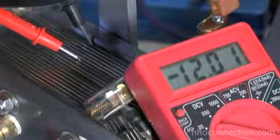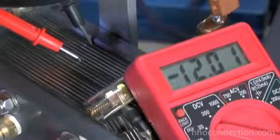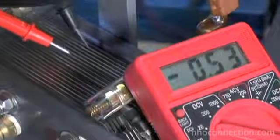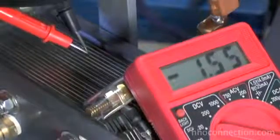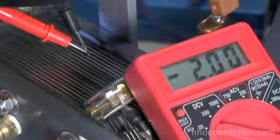So that's basically one stack: a positive and a negative with 5 neutral plates in between, giving you a total of 6 plate gaps and 2 volts between plates. And if I take a reading between any two plates that are side by side, you'll see it's almost exactly 2 volts. I hope that makes sense.